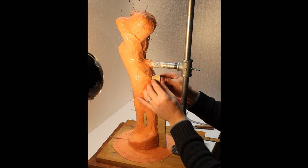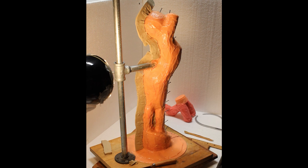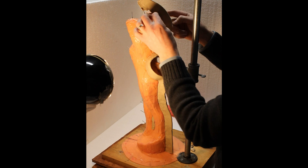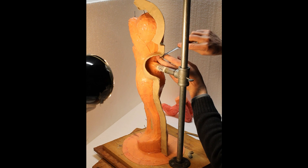Working around curves is where it gets a little tricky. When you create a little circle, make sure the mold is going to let that go. Ideally, the center section you're walling up should be pulled straight out, so don't lean the wall inward toward the center. The beauty of this method is you can manipulate the clay wall as needed, join it, and cut it just how you need it. If you need to cut a little extra to tuck it in and fill a gap, you can do that as well.